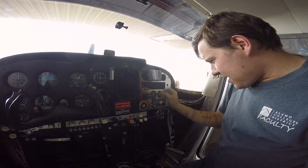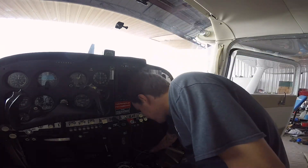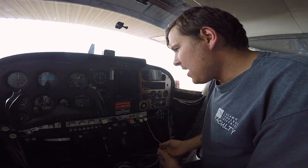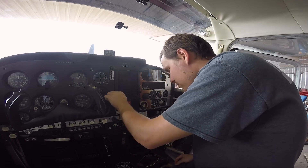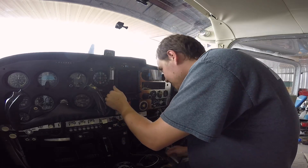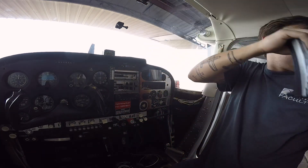The last real big thing I need to wire is the GPS pigtail. This connector here is for fuel pressure, which it doesn't have, so I'm just going to de-pin this from the plug and pull it out and get rid of this harness altogether. To hook the GPS up, I'm going to start by taking a 3/32nds Allen key, sticking that down inside the radio, getting a hold of the set screw and loosening it. Then once you get it loose, you just slide the radio assembly out. I like to support it in my hand and set it in the back seat.